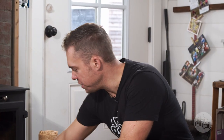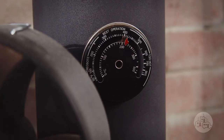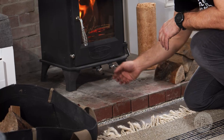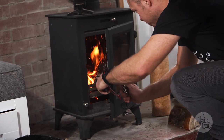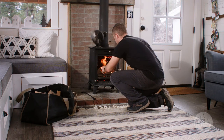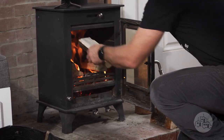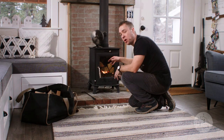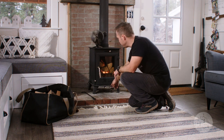We've been burning our fire for a while using just the secondary air. Our thermometer looks good — it's still towards the upper end of the best operation range. The flue is not putting out any smoke, just clear heat waves, and we're about ready to restoke it. You want to restoke when you have a good hot coal base and adjust the air when you do that. Getting ready to restoke, I'm going to open up my primary, open the door and crack it, chop up my coals, then add a bunch of wood. I'll keep the primary open until all of this is charred, then shut that primary and just do the secondary.